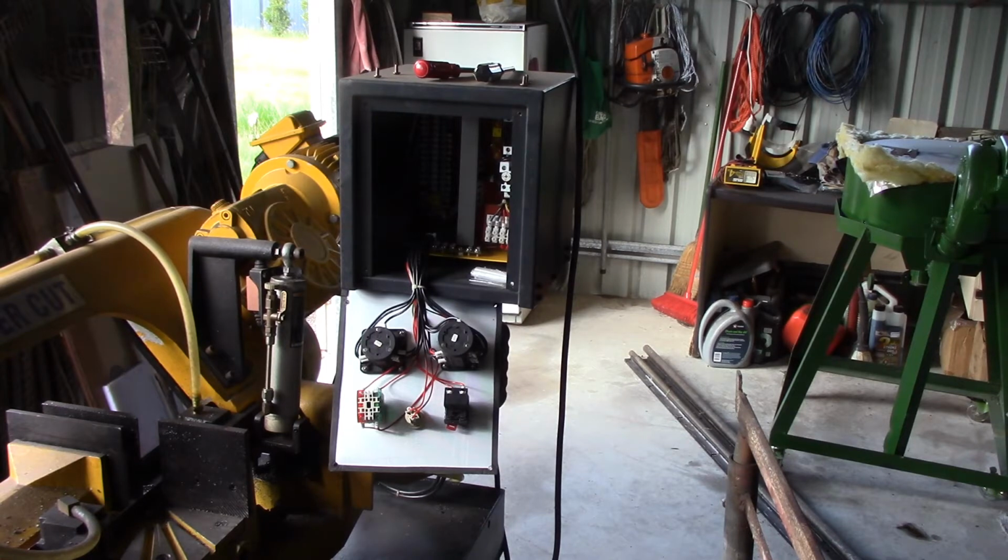The only thing I can think of is that since the last time I tried to cut some really hard metal and I had to turn it down into tortoise speed, and I put it back up to rabbit speed. That's the signs on the thing, tortoise and rabbit, for high and low speed. Anyway, that's the only thing I can think of that I've done different. So I'm wondering whether there's a fault in that switch, and that's what I'm about to start checking out. I've got all the power off it, got it open. I'll get the multimeter out and start probing the circuits and see if I can figure out what's going on. Yeah, one of those things.